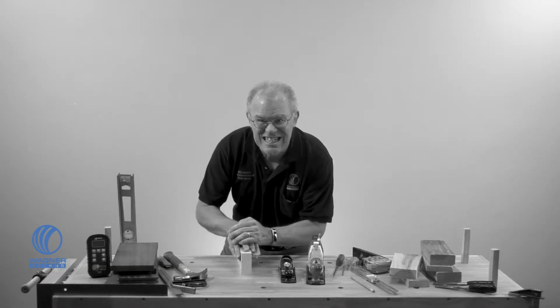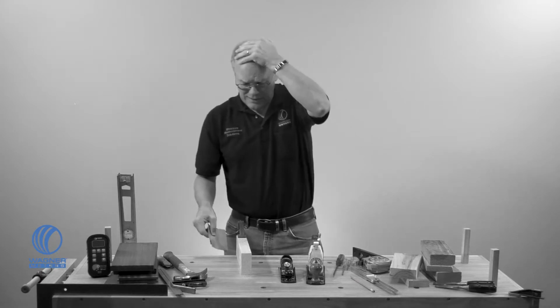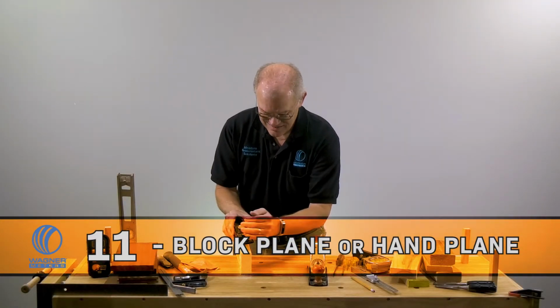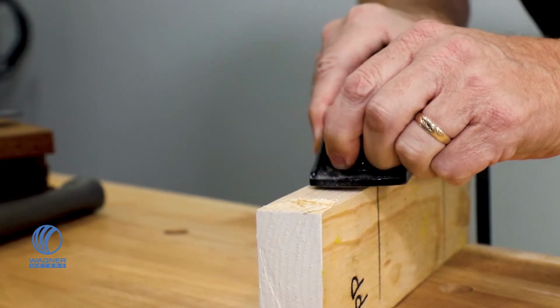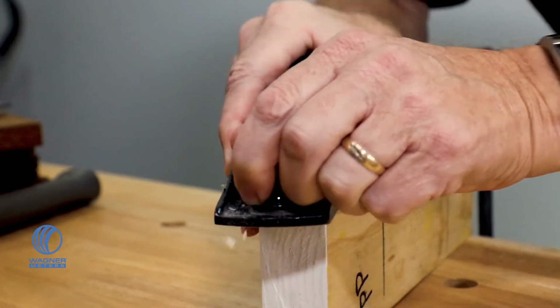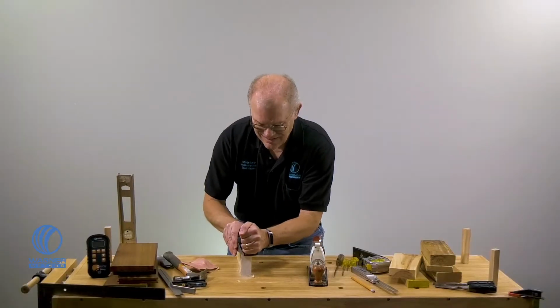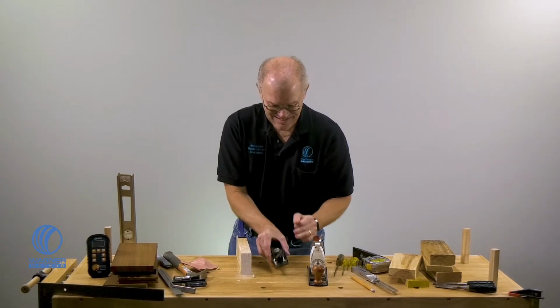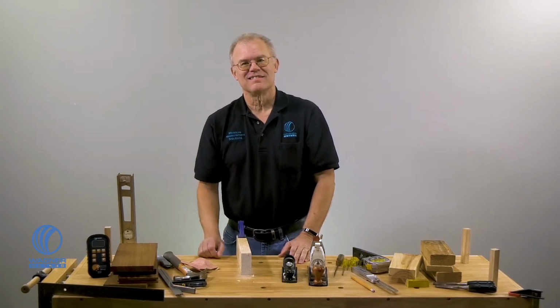Have you ever been tired of sanding that darn piece of wood flat, but just can't get it right? A block plane is a key to versatility in your woodwork. You can flatten a piece of wood, add a curve to it, or square your work. Shape or chamfer your stock using a block plane. Once you have a piece dovetailed, you can smooth the joint with your block plane rather than spend endless time sanding. Your plane can ease the edges of the piece, taking the sharpness out of it.